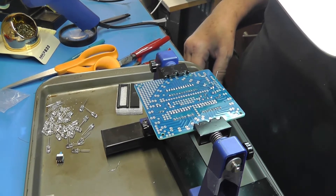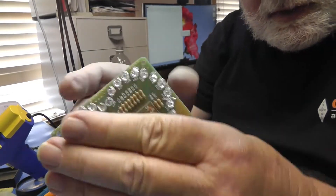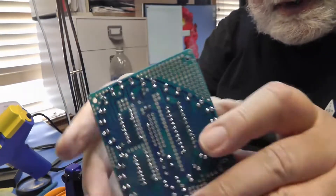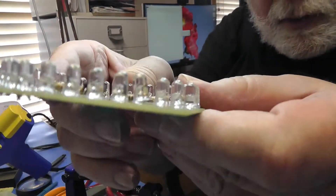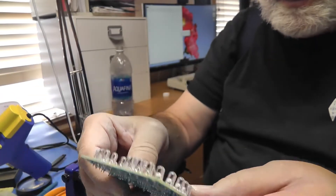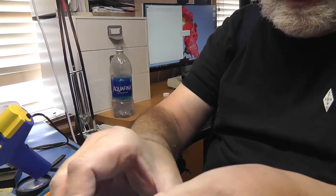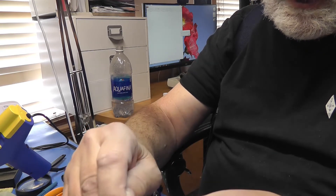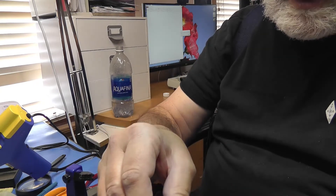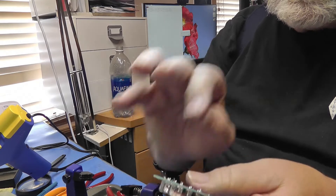The LEDs are all in a heart shape. They're all in and all flat against the board. The way you do that is by soldering one of the leads, then whilst continuing to solder the lead, push the component in until it's all the way there, hold it till the solder sets, and then solder the other one.